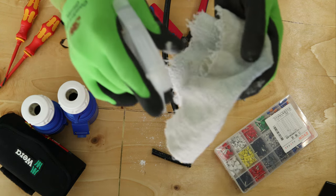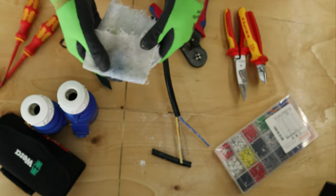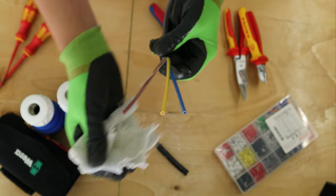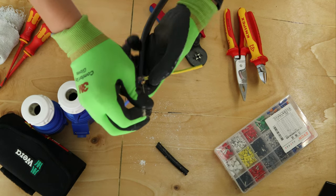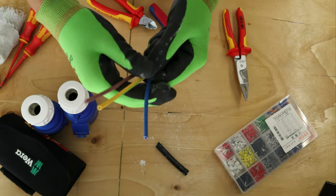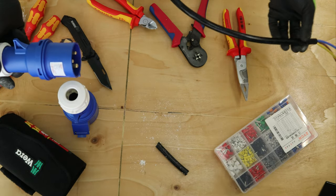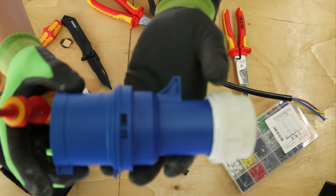What you do next — well, you don't have to but that's what I normally do — grab some alcohol and a cloth and wipe the cable clean. And anything that's not part of the three-core cable you can just trim it off. So you've got your three conductors — six mil. You can pull more than 32 amp with a six mil cable, or you can use four mil; four mil is just perfectly fine for 32 amp as well.